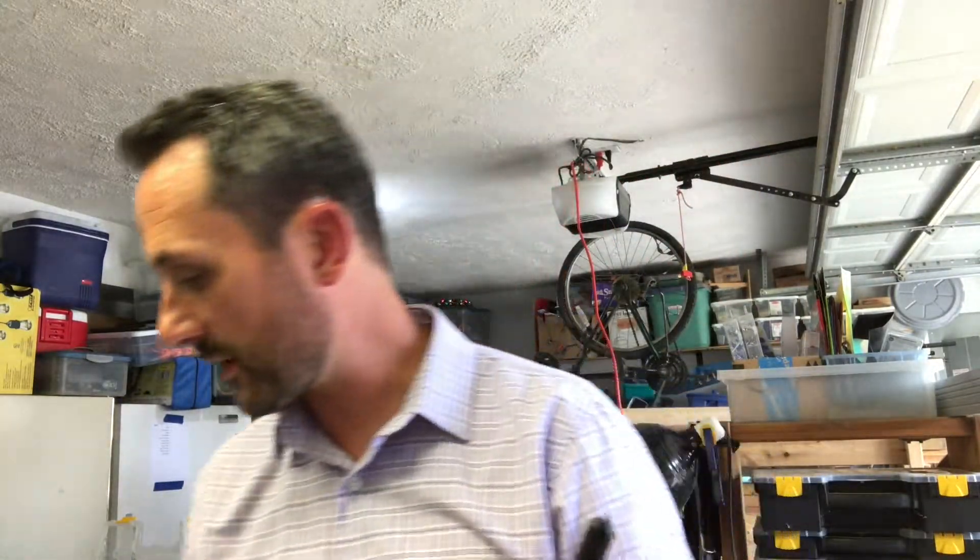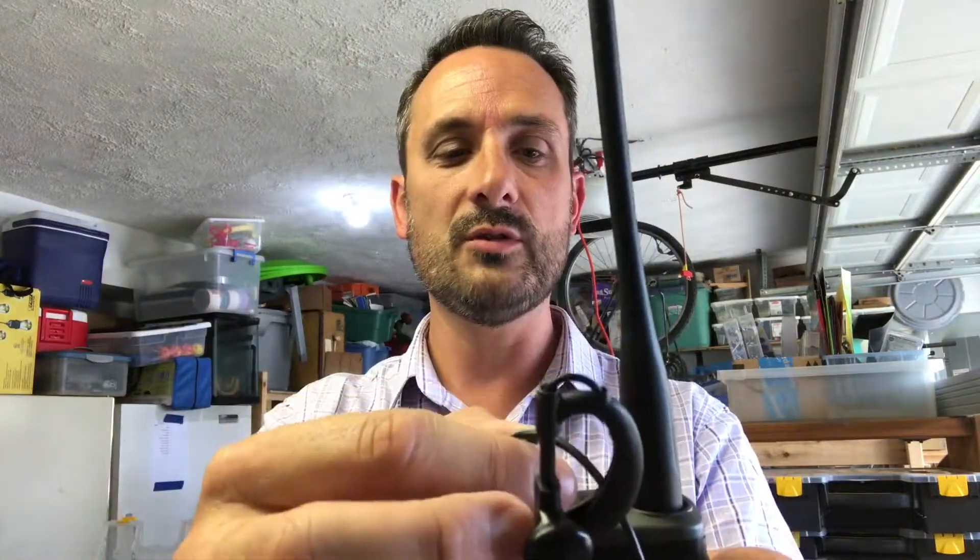The speaker stopped responding within the last few hours. I just got this a couple days ago from a friend and it was working fine. Now there is nothing — no beeps when you click the various buttons, no sound at all. But here's what's interesting: I've got it on the NOAA weather forecast, and if I put in the earpieces, the unit itself is actually working. I think the speaker's gone bad. Searching online, I found that quite a few people have problems with the speakers. I don't know if maybe something's messed up and the speaker is fine, but the electronics leading to it, or if it's actually something else. So let's get into it.